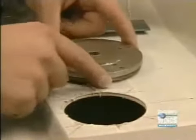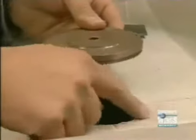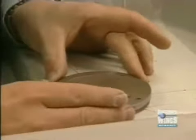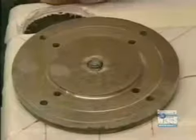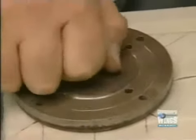Drill the holes to attach the gauge in there. Neville from the factory, you remember Neville, nice bloke, dodgy haircut? Well, he lent me this jig that he's made up. I've marked it up already where I want it to lie. That sits in the hole like that. Just dial it round until it meets the marks. And then from underneath, bolt goes through. So that comes up like that. That's it, sorted. And all I've got to do is drill it through.